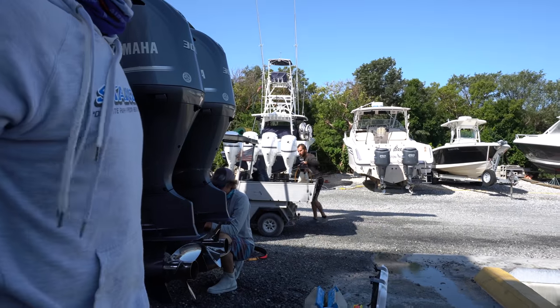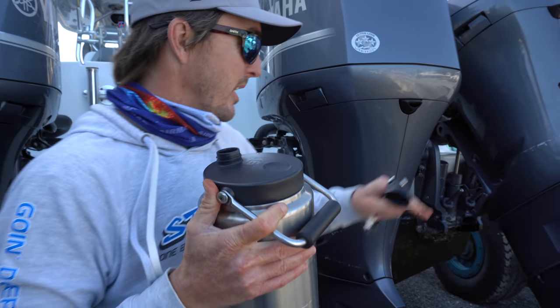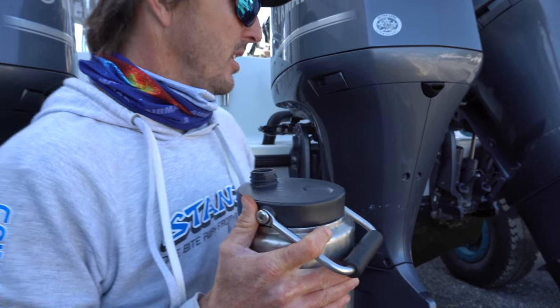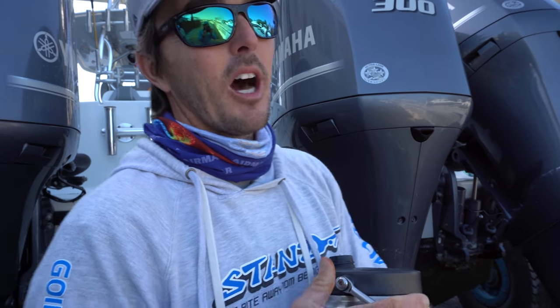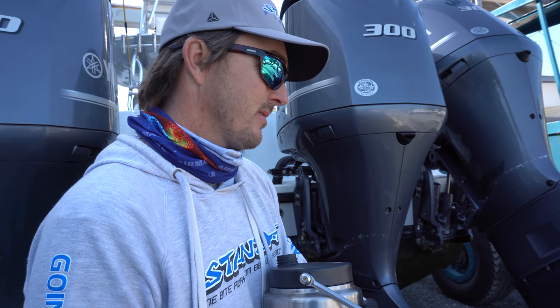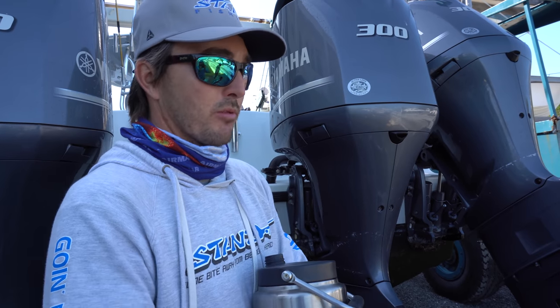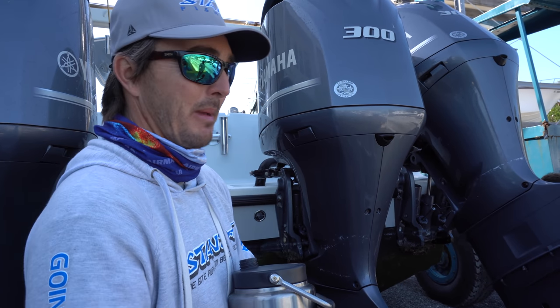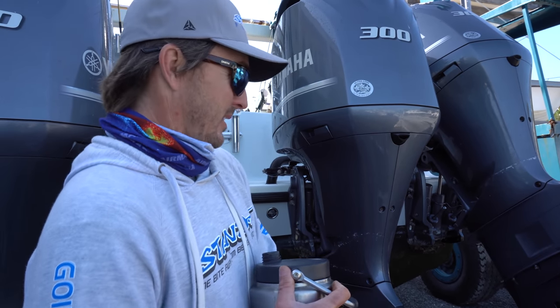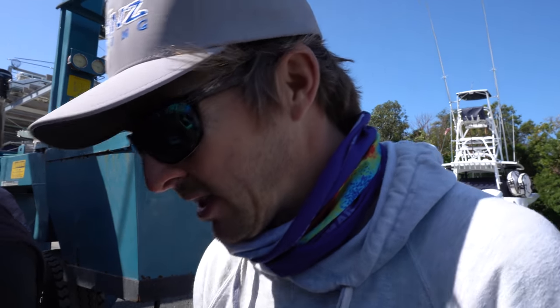That's the man of the hour right there — Danny's gonna get us fixed up. Look at that — magnetic right there. We're gonna drain the lower unit oil first, then drop the lower units and change out those impellers. Honestly they're probably fine — they're pumping water fine — but it's time to do them. When I sell these motors I want to show we just did the water pumps with new impellers, so it'll make it that much easier to sell. Danny's gonna get us fixed up. The gear lube's drained — time to fill it up with some fresh stuff.